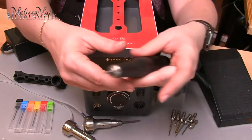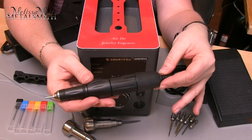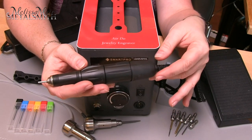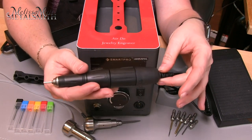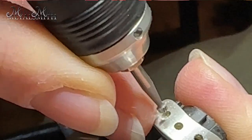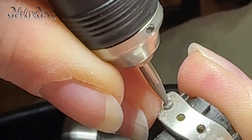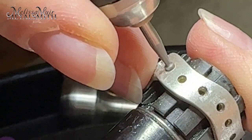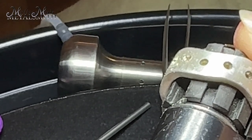The micromotor features a brush type motor handpiece. This is going to top out at about 35,000 RPM — more than plenty for what I do as a jeweler. Most of my accessories will only go up to about 20,000 on the maximum end. So this has really been helpful for polishing and for drilling. I do find that when I'm drilling sometimes, especially if I'm doing larger items or working in something a little heavier, the torque is a little less than desired, but it has still been able to do all of the tasks I've asked of it.